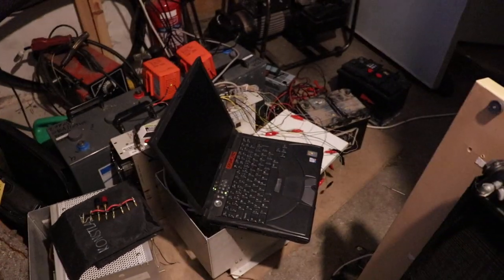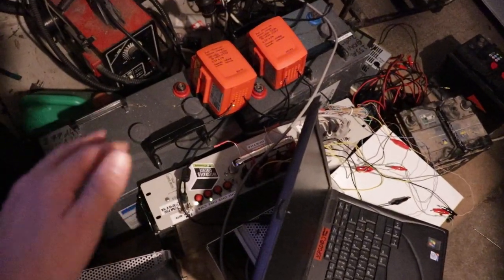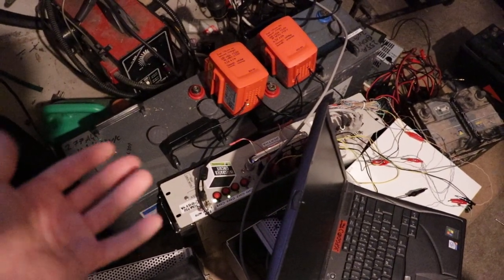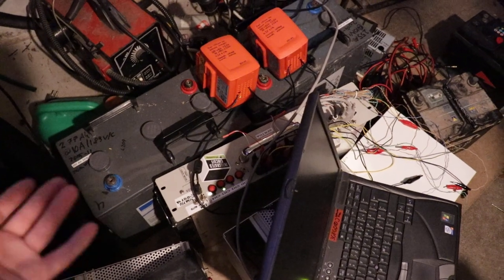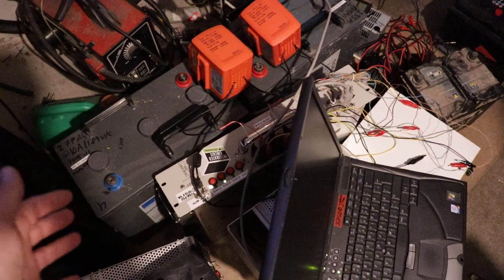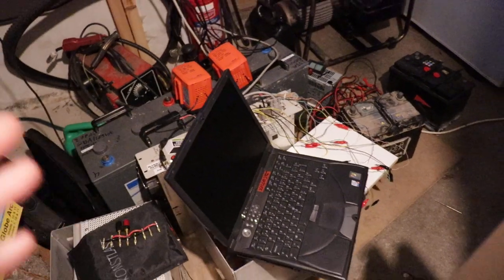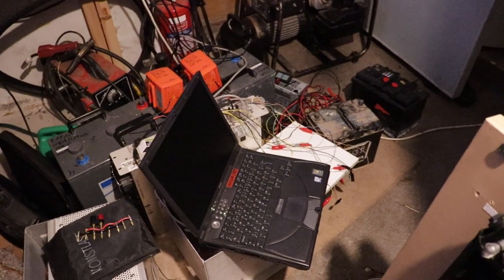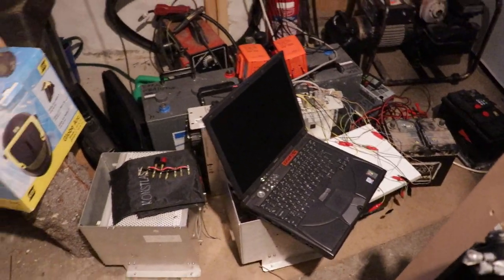The way I've tested these is I've used my proper battery tester at 10 amps, which shouldn't be a problem for the 12 amp-hour cells even if they're not made for higher rates. That's a bit over 1 amp per cell, shouldn't be a problem. This is a rather accurate device — it's not going to be measuring wrong; it uses four-wire measurements for the voltage cutoff and so forth. It's a good way of testing them.